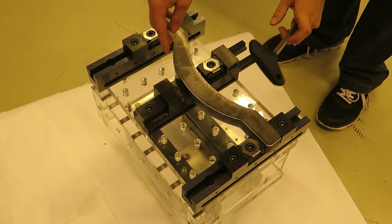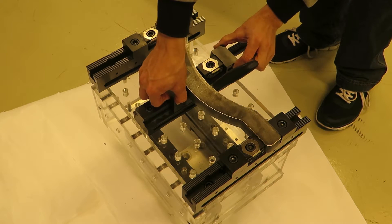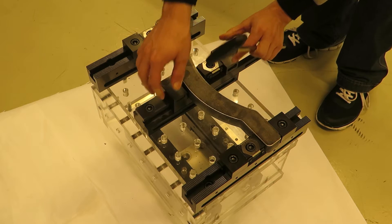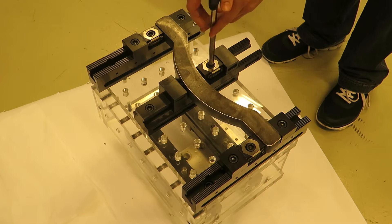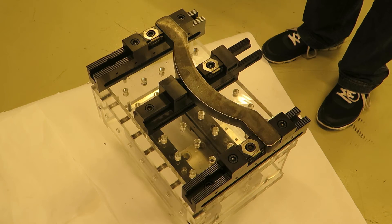And in the middle, the place of the midpoint of the workpiece can vary. That's why we have a floating installation. And when we start clamping the combo rail, and when both jaws have touched the workpiece, then we clamp the combo rail around the workpiece. That's what we call floating mode.